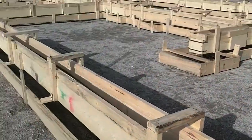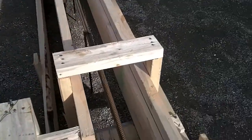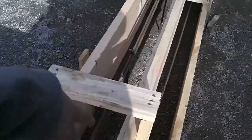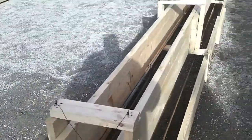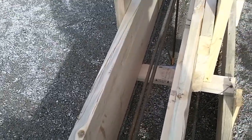Today what we did was finish off all the rebar in here. You can see now all the corners have been bent and tied together, and there have been stakes put in. Usually they don't ask for these pieces, but we like to put them in because it keeps everything straight. The biggest problem with rebar is that it moves when the concrete pours, but this way it doesn't.